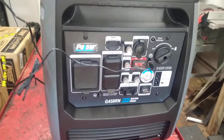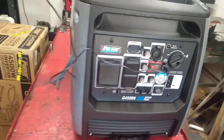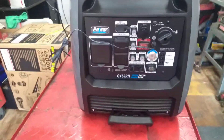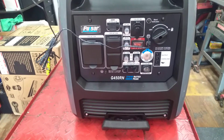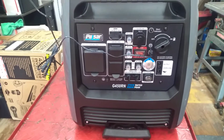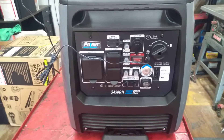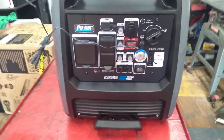I'm still learning. I've already done the generator's break-in period — I ran it for roughly 30 hours and put a load on it on and off. I haven't put a full load on it yet, and I'll probably do that here today.